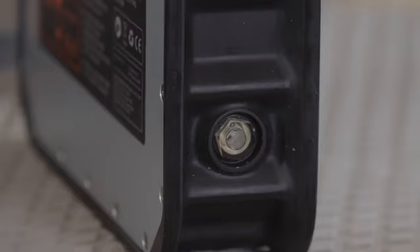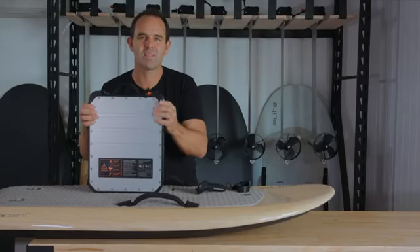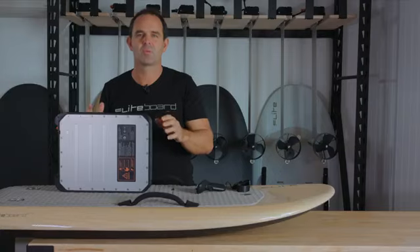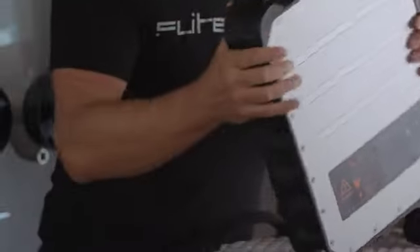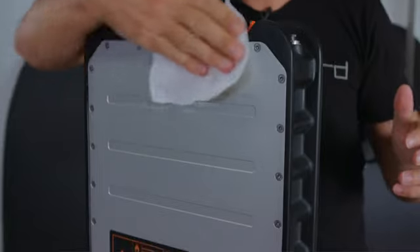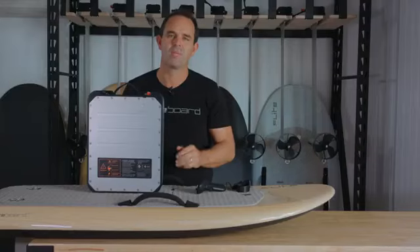You can do this via the sight glass. Stand the battery upright for 15 seconds and then on its side with the sight glass down for 15 seconds. This will allow even a small amount of water to make its way to the sight glass. If water is present, a color-changing label in the sight glass will turn red. Clean and dry your battery to keep it clear of sand and salt with a cloth. Don't hose it — we want to keep the flight cell dry.